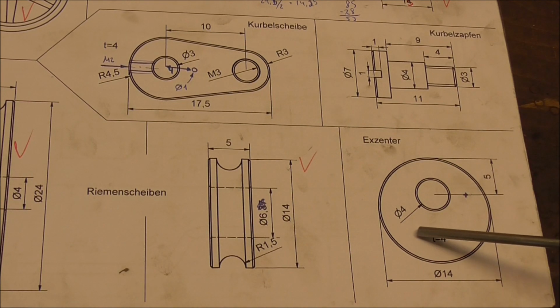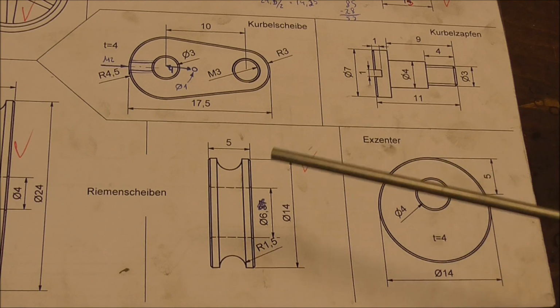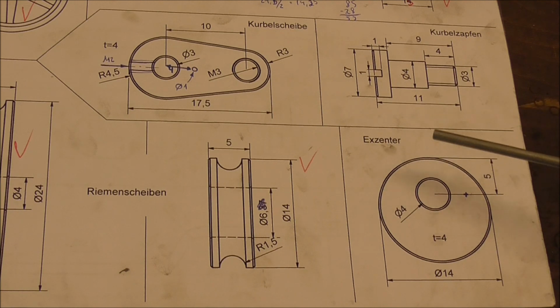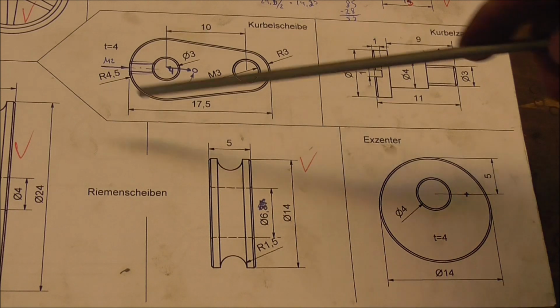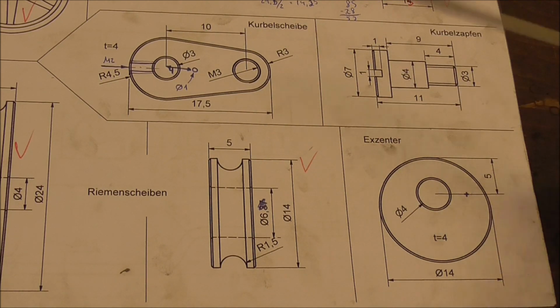Now, milling a key slot round like that isn't possible in my machine shop because I don't have one of these cranky rotary thingies, and I also don't have a milling cutter small enough. So yeah, we're going to make this thing straight hole, straight pin, and no lollygag, and it's just going to run in one direction. To me, it's not that big a deal. I run my machines in one direction only most of the time anyway, so that's how it's going to be.